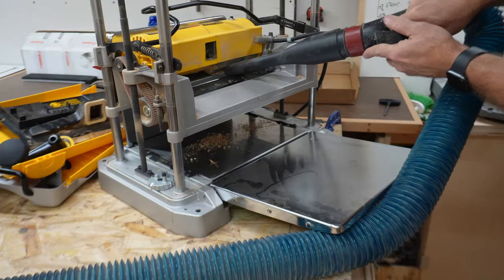You can use the screw gun for removing the screws, but don't use one to put the new screws in. It's too easy to over-tighten. The carbide inserts are brittle and can crack under too much pressure. Remove the knives. Be careful in handling these. Even when dull, they're super sharp. Raise the thickness planer to the top and lock it in place. Use a 3mm hex key to loosen the set screw on the chain sprockets, and then inspect the sprockets for wear.